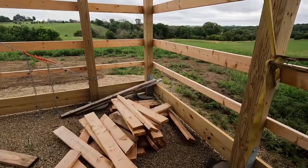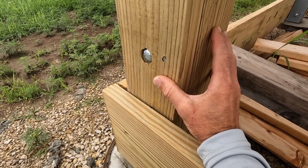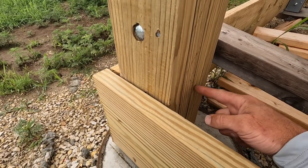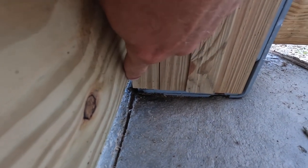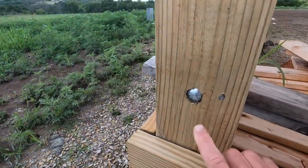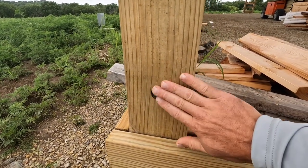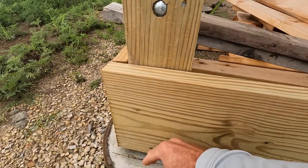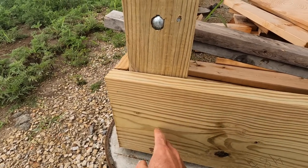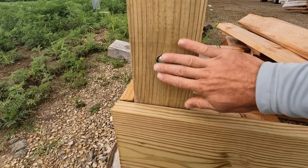As far as the corner brackets or garage door opening, this is a corner column, so you can do this in two ways. You can use a universal bracket, or you can use a wet set bracket and cut half of it off, which is what we did. I started doing that, so this is a wet set bracket, and then I just cut this side off. And then we use carriage bolts. You can use a regular bolt too, and then you just have to suck it in where it's flush with the column. This one you necessarily wouldn't have to do that, but down here where the grade board goes, you would have to do that, or you'd have to drill a hole and do it. So this is just how it works out good, just to use carriage bolts, suck them in flush.